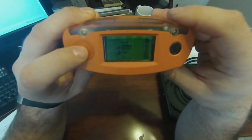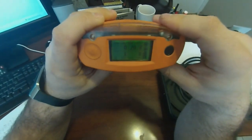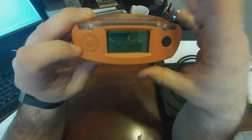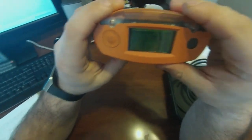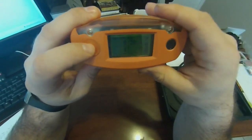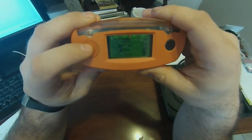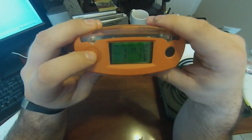When you get to what you want — we'll check 'Peak' at this point. Our peak on this one has been oxygen down to 20.8 at one time, and we had one part per million on CO. It's asking me if I want to clear — I'm going to tell it no, I'll leave those values in there. If you wanted to clear out your peaks so you could keep a record of new peak values, you could do it at that time. To go back to Gas, you go to the menu by double-clicking, then single-click to get to where you want. We were wanting to go back to Gas, which was the first one, so double-click again and you can see all your readings.